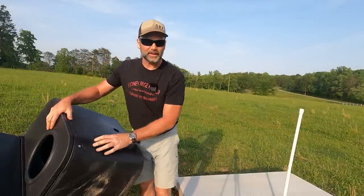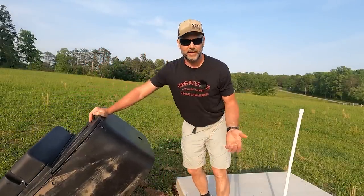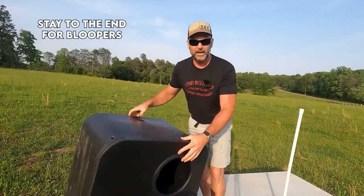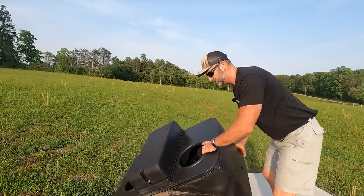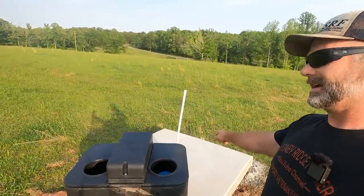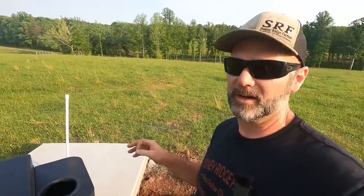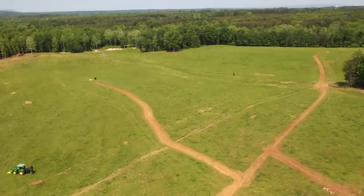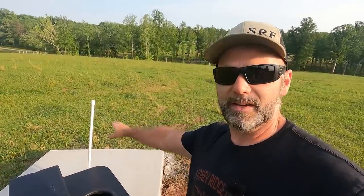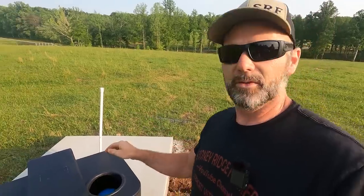This is really a two-person job lifting this thing and putting it in place, but I'll show you how one person does it. First thing we're going to do is get the Mirafount waterer over here on our concrete pad, and then walk you around it and show you exactly how everything works. A lot of hardware comes with these Mirafount waterers. Down in the ground I've already done some plumbing work — inch and a quarter poly pipe runs throughout the entire farm. We have to reduce it down from inch and a quarter to three-quarter inch, which is the size of all the piping for the Mirafount waterer. We put in a curb stop valve that drains the water back out of the pipe stubbed up here.